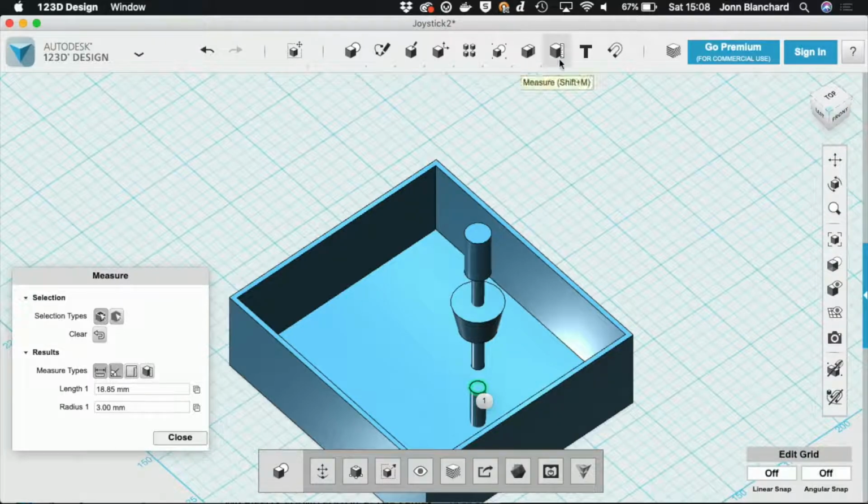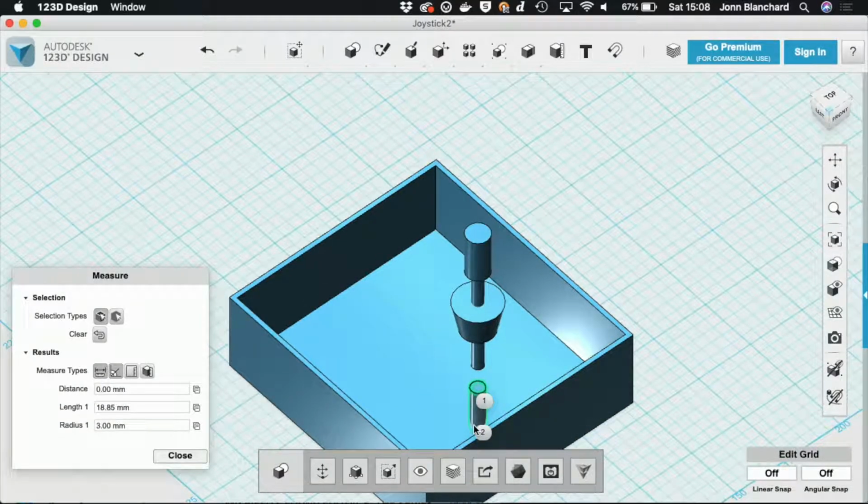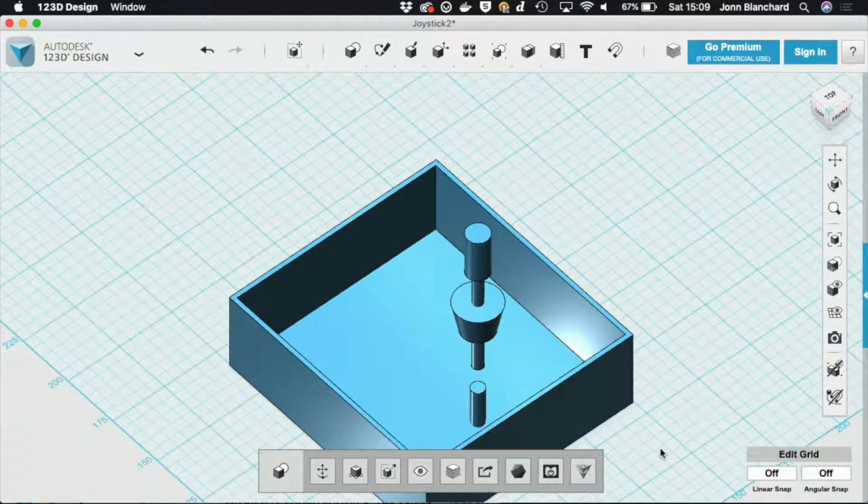Now, in terms of the height, 18 millimeters, that's not bad either. Let's just refresh our memory on what the length was of the uncompressed spring. 35, 18 is about right. Yeah, that's pretty good. So we've done all right, actually. These are pretty good. We need to just slightly increase the size of the bottom peg, just so that it's slightly wider. I'm avoiding using the word girth just because I laughed about the shaft things earlier. So yeah, that's what I mean anyway. And the top one's all right.